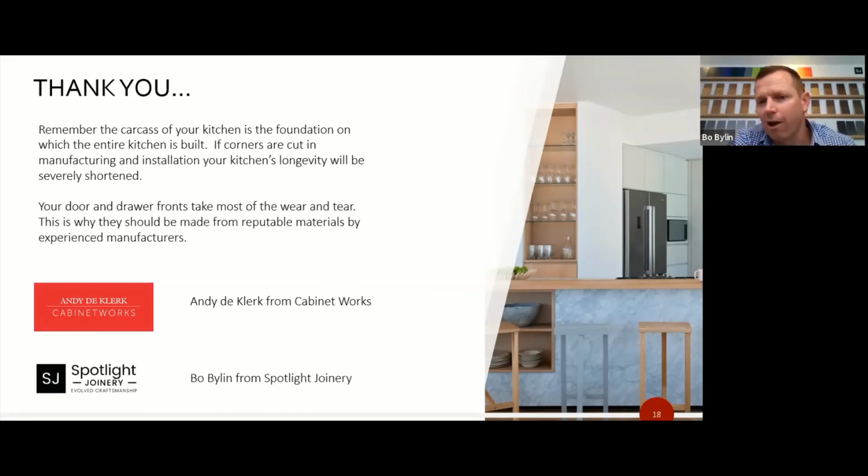So generally, like Andy's saying, we would specify that as a semi-solid shaker door, not just a solid shaker door. In terms of having the option of that center recessed panel being solid timber, it is definitely doable. Not that desirable to have it in a 6 or 9 millimeter. We would generally have to run some rebates, and you need to allow for movement.